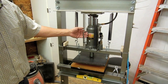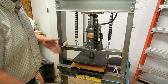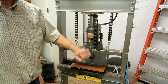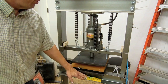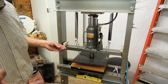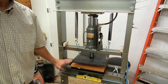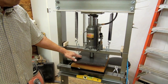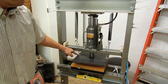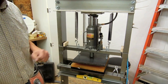I've replaced the standard 20-ton hydraulic jack with a 20-ton air hydraulic bottle jack. That way I can use air to assist in pumping it down so I don't have to go forever with the hand jack. I've then taken two 12-inch by 12-inch, 3/4-inch steel plates from a scrap yard cut to size. One is sitting on the bottom of the hydraulic press, and the other I've suspended slightly underneath the piston — threaded with two quarter-inch holes on the edge — so I don't have to remove and add it back all the time.